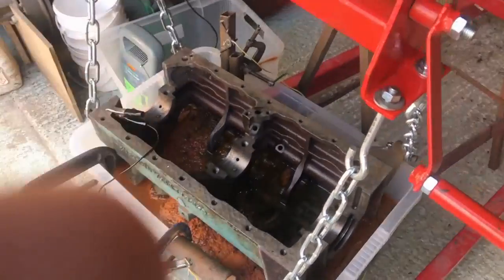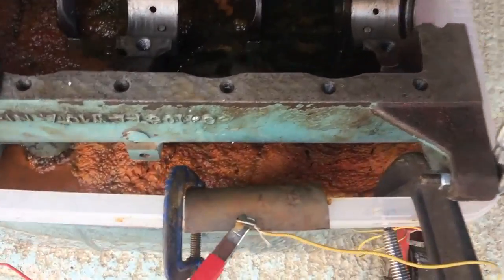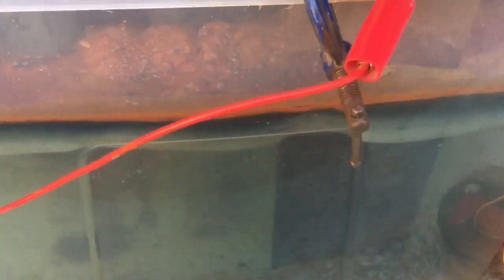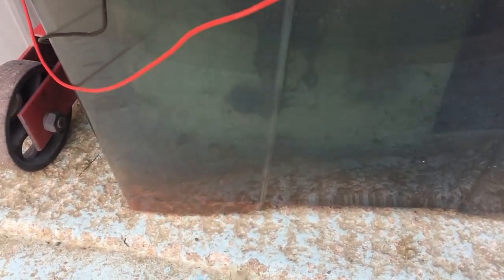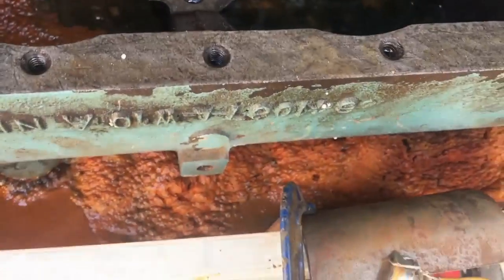Okay, morning guys - it's Saturday. I turned this off last night, it's had about two hours last night and about two hours this morning, and as you can see just like yesterday we've got all the rusty bubbles on the surface where the oxidation is breaking down. Apparently the electrolysis pulls the oxygen out of the iron oxide - the rust - and the rust falls away. You can see in the bottom here we've got quite a lot of rust building up already - a total of about three hours I guess. There's quite a lot of sediment building up, so I'll pull this out today.